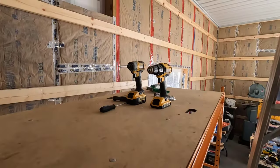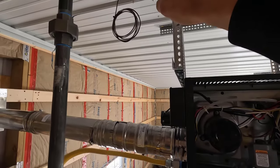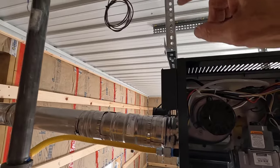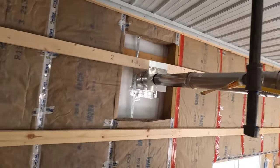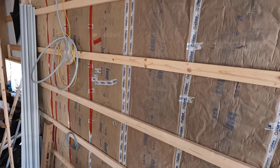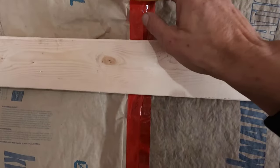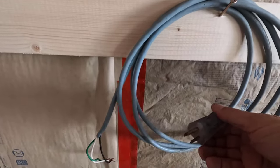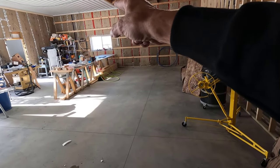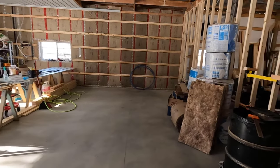The next thing to do on this is to get the electrical from that box up there. I gotta run some BX down to here. I need to connect the thermostat. Then I need to connect the electrical temporarily with this wire right here. Connect my Romex to this old destroyed extension cord. And then I'll run an extension cord all the way around to the entrance panel over there to get electricity.